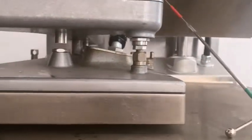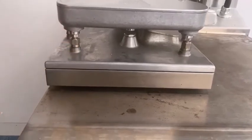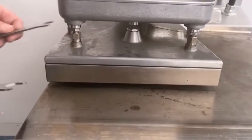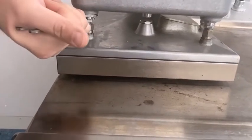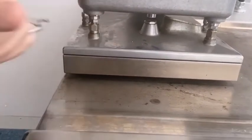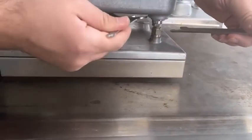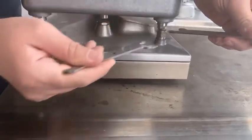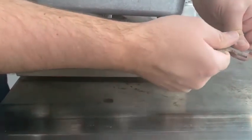That's now perfect. So now we've gapped the grill. We now need to tighten the adjusters. You need two tools — you need to hold the lower nut and use the other side of the wrench to tighten it. It should be nice and tight to stop it slipping. If you don't do this, the gap adjusters are going to come loose and it's going to change your gap. And then you'll be back within a week to re-gap it again.